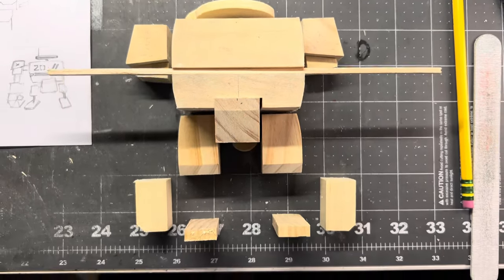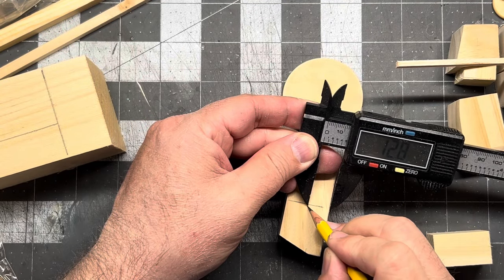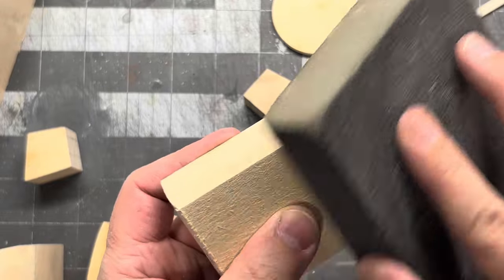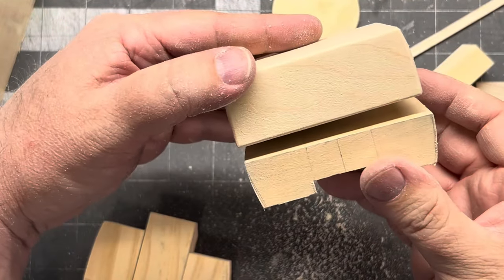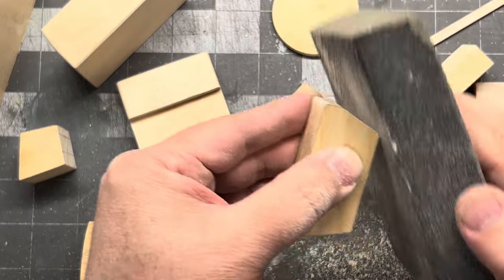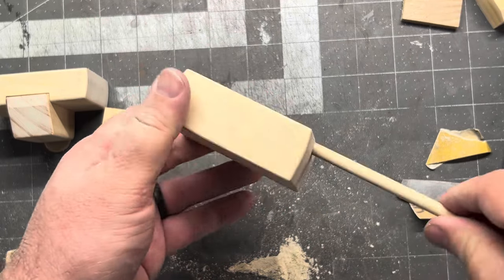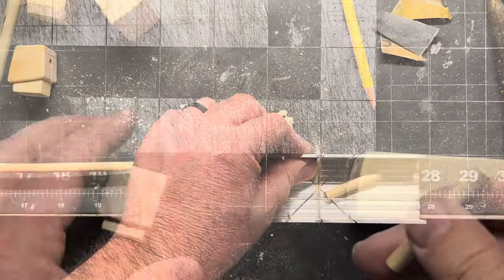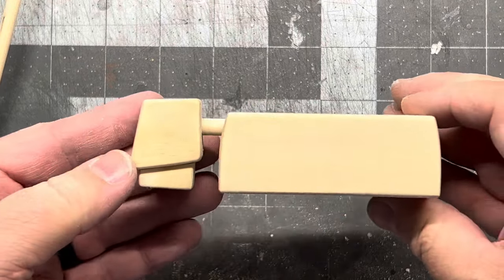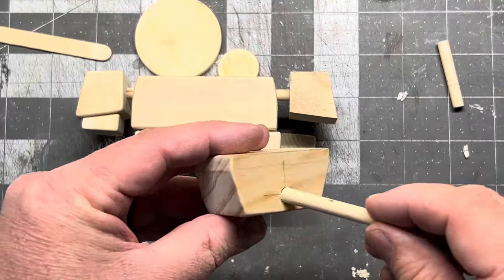Here's all of my parts cut. I'm going to start doing a ton of measuring. A lot of this is getting the holes in the correct spot so everything is balanced properly, and sanding all the rough corners. Woodworking is really interesting because you're doing a lot of just meticulous, tedious work — the sanding, and my fingertips are killing me because of so much sanding. Here I've got the shoulders drilled out and with some really precise measuring, I used my drill press so I could drop the hole the exact same size on both pieces, so when I cut my pegs everything would still line up and be completely even.